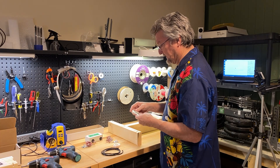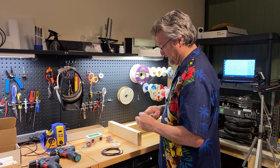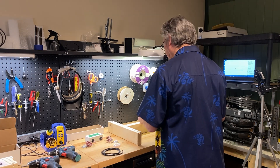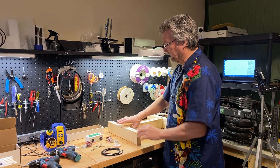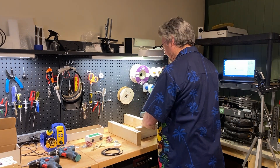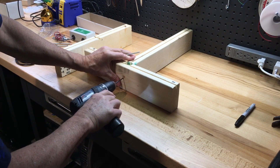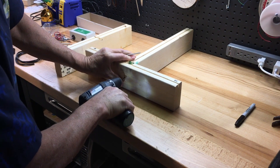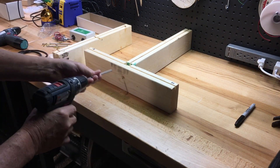Take your little parts bag — it can be sort of a booger to open. You'll see a couple of long screws. We're going to put two long screws in this end and one long screw in this end. We recommend that you pre-drill the holes. I'm using an eighth-inch bit for that, and then we'll put this nice long screw in here.